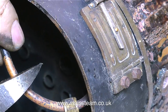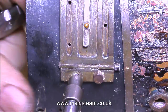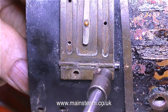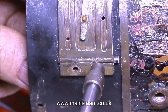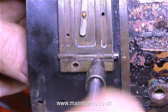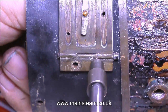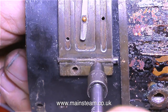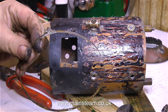In this clip you see me cutting the piping with a pair of side cutters - the only way I can do it because the pipe was threaded through a hole in the firebox area of the boiler, so I couldn't just pull it through. Now it's time to remove the fire hole door. As this is not a coal-fired boiler, it's not strictly a firebox, but I'll refer to it as firebox so you know I mean the bottom end of the boiler, as opposed to the chimney end at the top. This part is simply referred to as a boiler band - there are two of these on the boiler, and both are now removed.